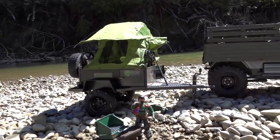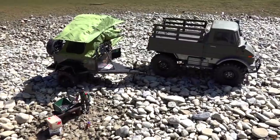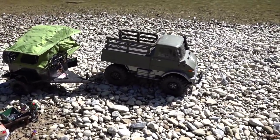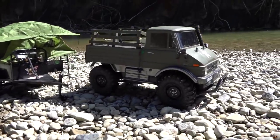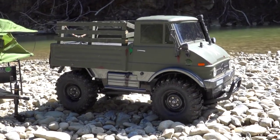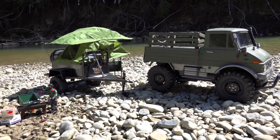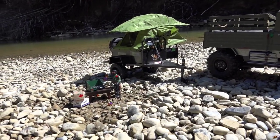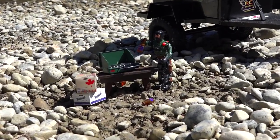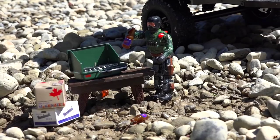There you go. The camp has been set up. The Unimog from Tamiya, or Tamiya, or Tamiya, wherever you're from, pronouncing it however you like. This is a CC01 running simply on a 2-cell LiPo battery, a Savox waterproof servo, a Spektrum receiver that's also waterproof, and my one lone army dude that was heading up this whole project, tipping a cold one for you guys.